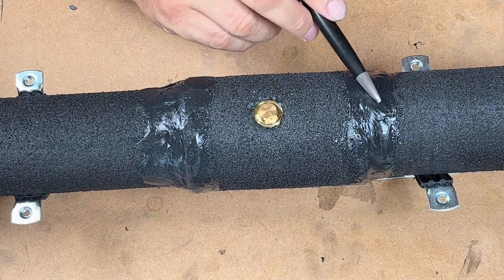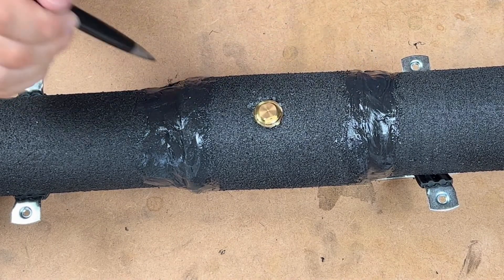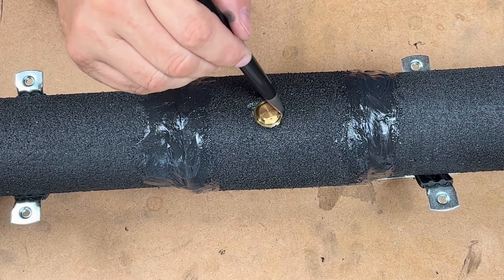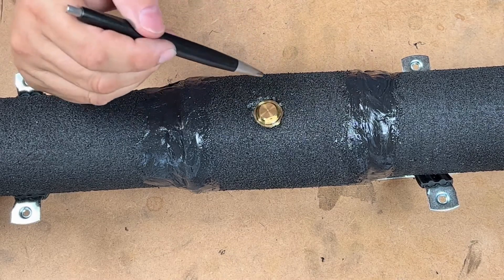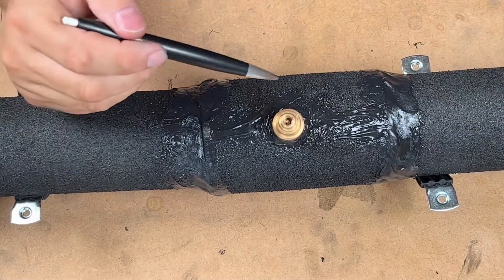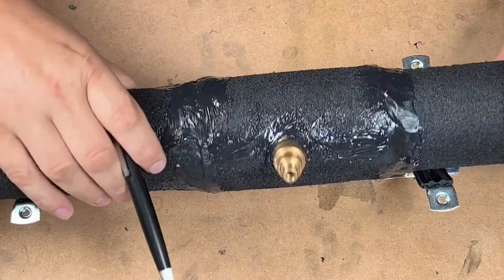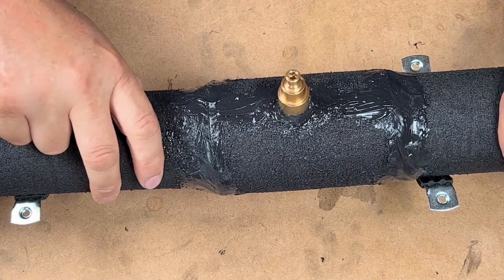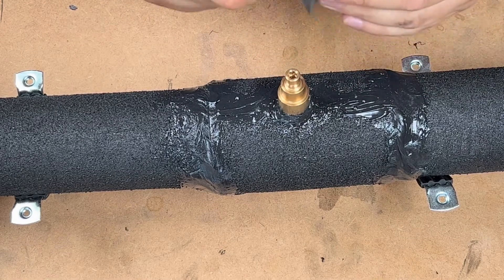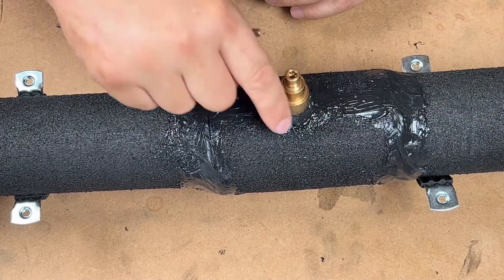We've finished now. We've sealed both sides, capped and sealed so no moisture can get in and no energy can get out. We've also sealed around the top where the vacuum brake is, but the vacuum brake is all clear. On the bottom where the thermostatic cartridge is, this area is exposed but all the bottom is sealed and capped. If you wanted to, you could cut a piece of insulation and use bond and seal to protect those areas and bond it onto there for some extra insulation.